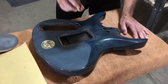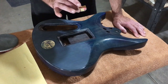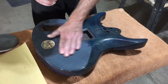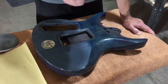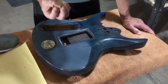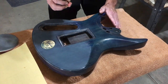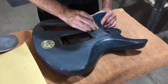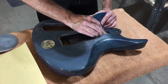The technique I use when I level sand is to sand in a circular motion. The reason I do that is because it sands a lot faster — you can bring down that sheen quicker and get the surface level faster. Some people will say you shouldn't sand in a circular fashion because that'll leave swirl marks, but I've never found that to be true. I think part of that is because of the method I use for buffing, which I'll explain when I get to that stage.